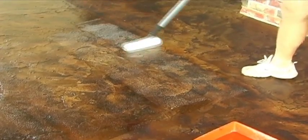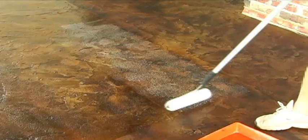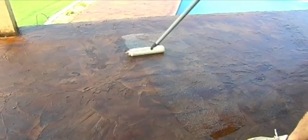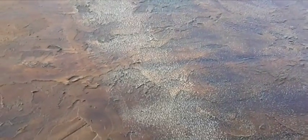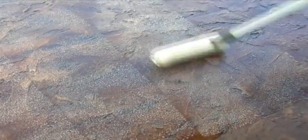Do not walk on wet sealer, as it will leave permanent impressions on the floor. Apply at least 2 coats of acrylic sealer to outdoor concrete for increased durability. Acrylic sealers should be reapplied to outdoor concrete every 2 to 3 years, depending on traffic and weathering. DCI lithium hardener sealer is applied once and should not require reapplication.